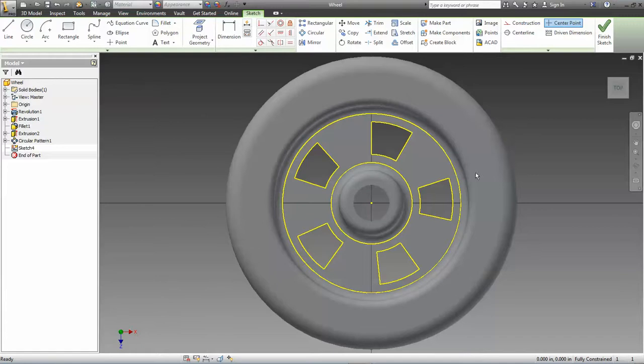Okay, so I'm going to create a circle, and I guess the easiest way to do this is to create it maybe on this side, on this axis here. I made it a little bit harder for myself making this 5-hole wheel, but that's okay. It'll still work. You'll notice the center of that cylinder is 0.70. Now I'm on the negative side, so I'm going to go negative 0.70.